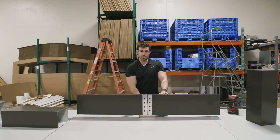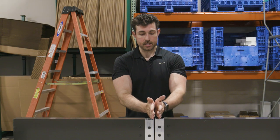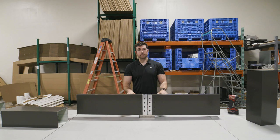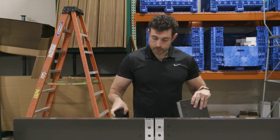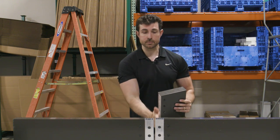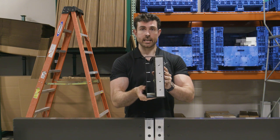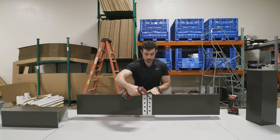So now for our purposes let's assume this is on the post — I lowered it so you could actually see what I'm doing. These are our two 12-foot beams coming together for a single 24-foot span. Now we have to get the beams going down the middle. These are going to behave as two separate units that are combined, so we're going to keep the entire frame for both units except for that post. When you get your luxury pergola you're going to see that there are screws on both sides of that beam — you're going to want to remove the screws where the two beams come together right here in the middle. You're going to get up on your ladders and place these two interior beams right next to each other, then drive your screws in from the outside.